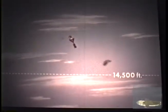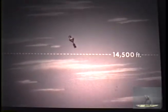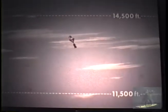As we've seen, if the ejection takes place at an altitude above 14,500 feet, the time release mechanism is in a ready condition but will not actuate until its barostat senses that the seat has descended to a safe altitude. But if the ejection takes place within the 11,500 to 14,500 foot altitude range, the timing mechanism begins to run immediately. In any case, from the moment the time release mechanism begins its timed run, approximately 2 1/4 seconds later, the rack plunger becomes fully extended and the shackle release plunger is released to contact the harness release lever. This frees the occupant from the seat by releasing his leg restraint cords, his restraint harness, and parachute restraint straps.